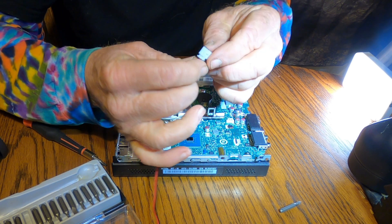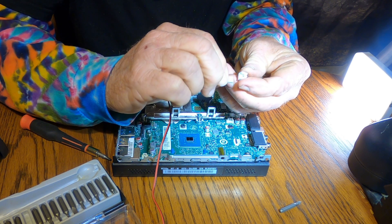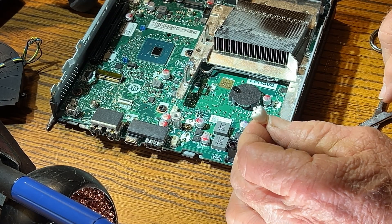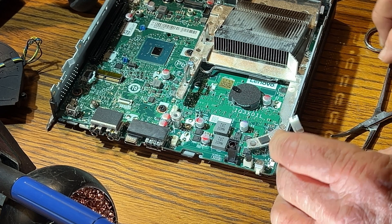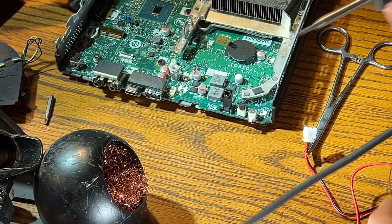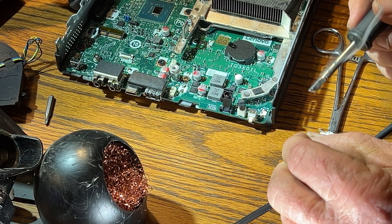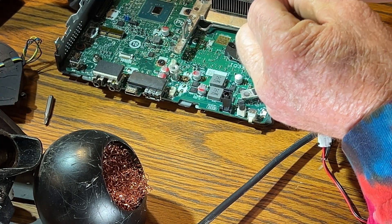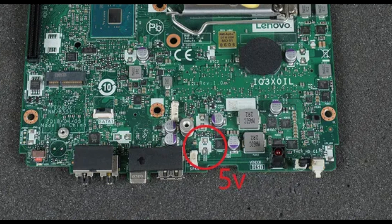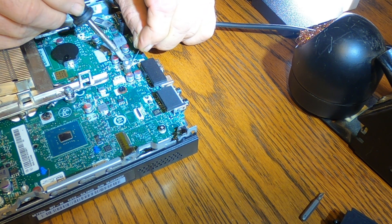It's got a little bit of tin on there and I want to avoid having to bend these. If this doesn't work out, I'll just cut that connector off and solder it straight to the motherboard. I've had to bend the legs a little bit and shorten them up a touch. Now I need to add a little bit of fresh juicy solder to those legs. Here's the motherboard location we're soldering to — it's labeled for positive and negative. It had old hard lead-free solder on there; we want fresh juicy lead-based solder on there.